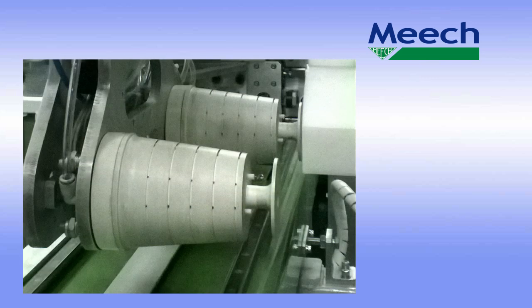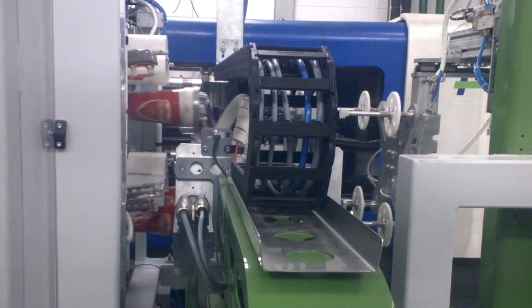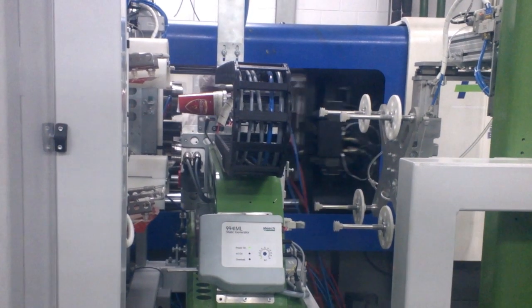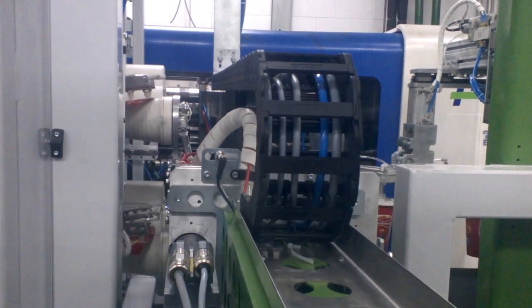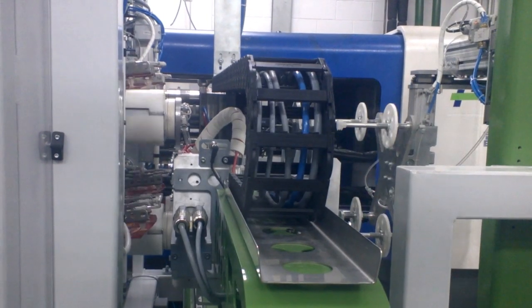The third designer mandrel is for a tapered container, such as a cup, which is shown in operation during the following film clip. The side access robot collects the labels from the label magazine. The labels can be seen to self-wrap around the mandrel. A mechanical label collar can be seen closing around the label and mandrel. This is useful for label thicknesses above 120 micron.